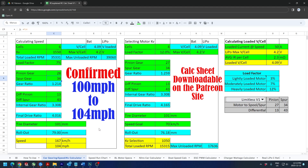At the end of the day, there really isn't much of a difference when it comes to increasing timing from low to high on a brushless motor. This is where we come into this very video, because it is very important if you own and operate a delta-wound motor — and even more important if you operate a very high performance delta-wound motor. Those are motors where turn counts are essentially somewhere around one turn, which is a hot wind, especially in a larger brushless motor, capable of several hundred amps of continuous power. This is what is known as a hot setup for most radio control vehicles.